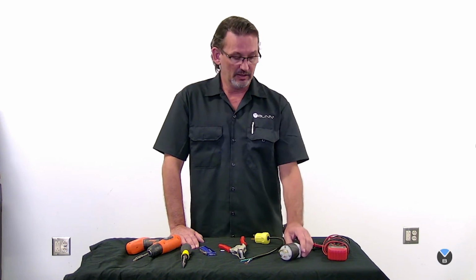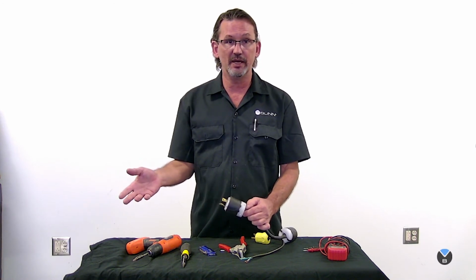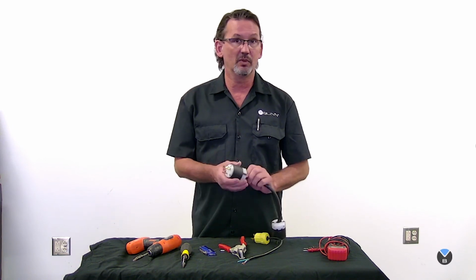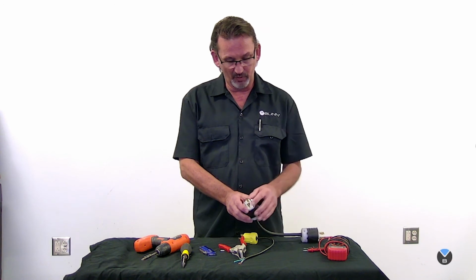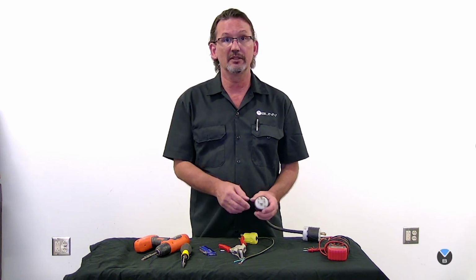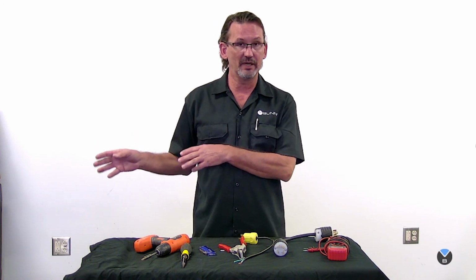And one common mistake is that you take a plug off of a machine and you put a different plug on the machine to match the outlet that's on site, and you match up where the black one was, where the red one was, where the white one was, and where the green one was. The problem is you might have a problem in the wall that somebody messed up a long time ago, and then somebody might change the wiring in the machine to match that up. So for example, if you have the black and white switched in the wall, then on a 4-prong plug, you're going to have 208 or 240 going from black to white. In the machine you can move wires around and get the right voltage to the right place, but then the next person comes along, like you and I, and installs a new piece of equipment. The new piece of equipment is wired correctly, not incorrectly, to match the incorrect outlet. So the bottom line is just measure your voltage before you turn the machine on.